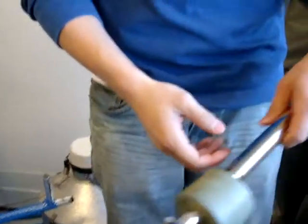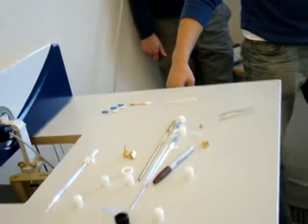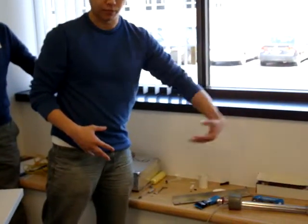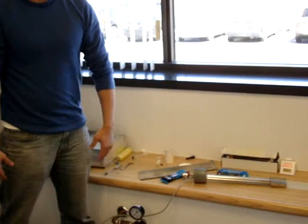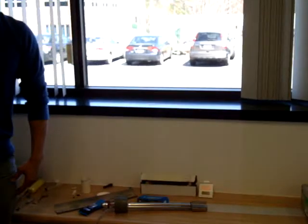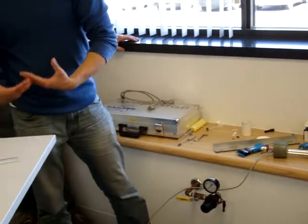Right. Oh, another thing. Actually, before I do this, I want to put the heater in. It's kind of confusing, actually, the way the software is designed. There's actually two heaters. One heater is for heating the nitrogen to warm it up. The purpose of this heater is to provide flow to the nitrogen. So that's actually called the evaporator. But next to it, there's a heater with parameters that you can set. So this goes in. This goes into that. Right. This goes into the nitrogen door. Yeah. So again, two forces. You have the flow and the heater acting against each other to stabilize the temperature.